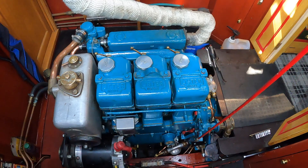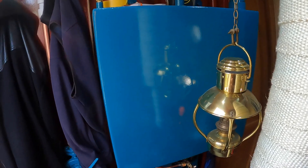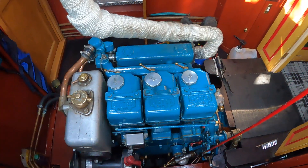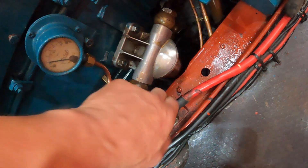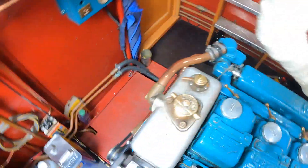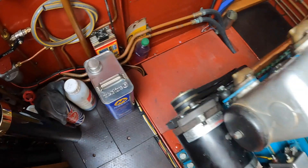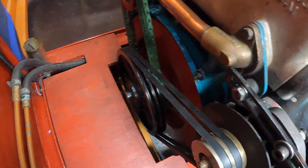She's all back together. This is another new addition — I've just put in a bigger day tank, about 40 litres. I had a small day tank before, which was 15 litres, but I could never get more than about 12 litres in it, which gave us about 6 hours of running towing the butty — it wasn't really enough. So yesterday we also changed the oil filter — it's down there, it's a cartridge, a bit awkward because there's a bolt underneath — and changed the fuel filter, just a standard sandwich type on the top there. With the valve clearances, that's had a good check round. We've got the Neof alternator on here which puts out about 130 amps when the batteries are right down, controlled by a Sterling alternator controller. Twin belts on the front — belts for the alternator and belts for the water pump.